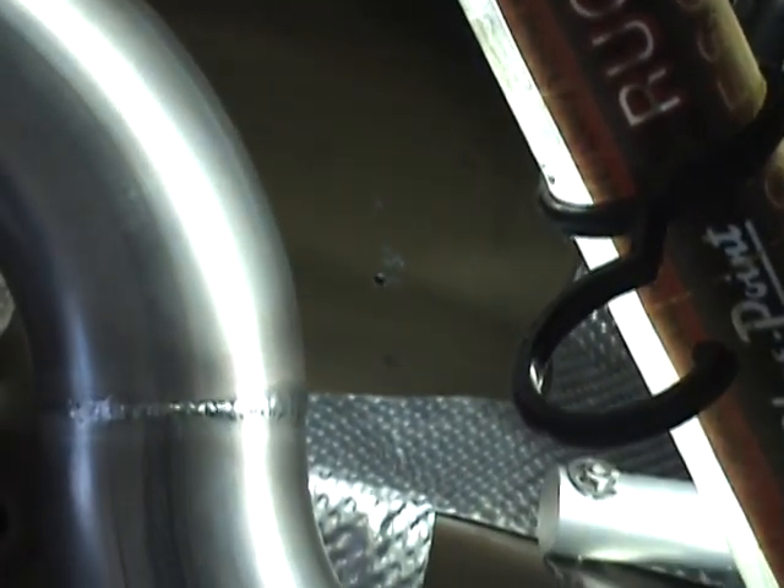There's the drilled hole. I want to check and see if I can push the underlayment back — you can actually push it away a little bit, and you'll see the underlayment through the hole. The drill bit is going to grab it and rip the underlayment into a big wad. So I'm going to get a 3/8 bit, make it really short with a tape stop, and we're going to punch it.